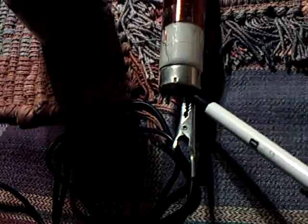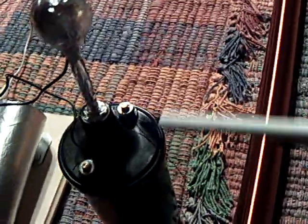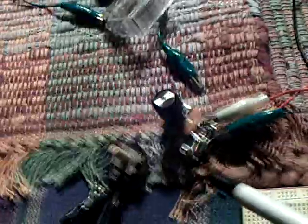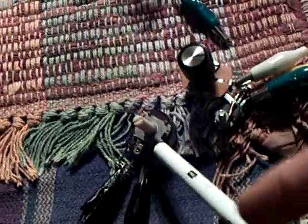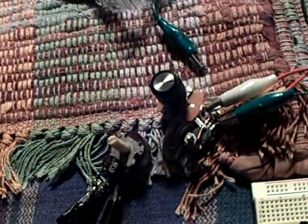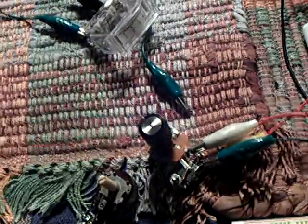The power comes into it on one wire right here, and then I'm going to draw the current off of it through this induction coil right here. Basically, a secondary coil of a Tesla coil is what I think I have here. I'm going to feed it into another coil, and you'll see energy coming out on this side. I did find out today that this 5-megohm potentiometer in series to the earth ground was really critical, at least in my circuit, to get the high voltage coming out the other side.